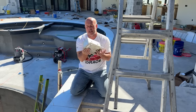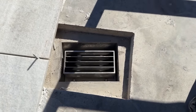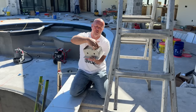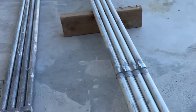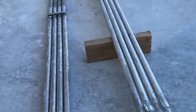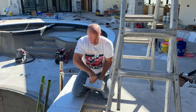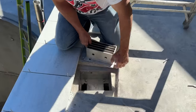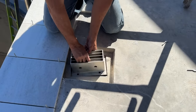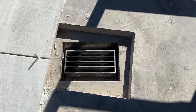So now this will receive those cables individually into these slots, come up, over 4 of the pulleys, across over 4 more pulleys. They're going to go down another set of tubes just like that, that we'll call the dry side. That side is inside the house. So this will have water in it to the water line. This side will always be dry. Then if you look inside here, you can see pins. These pins are machined and set exact. So once this drops in there, the cables align perfectly centered and make no contact. So I've taken all the play out of it.